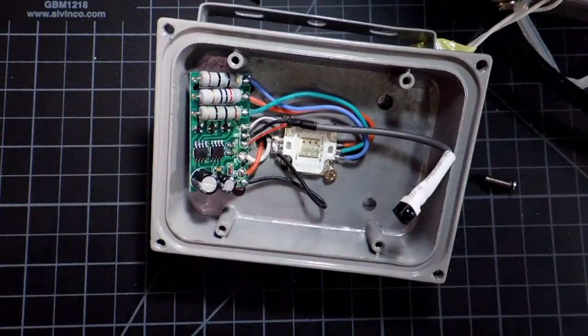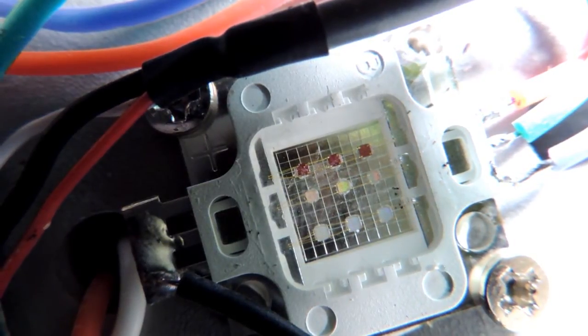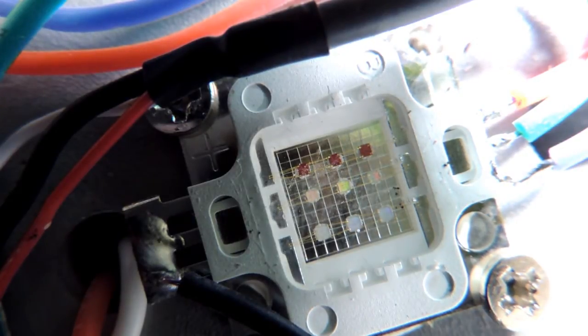Let's take a look at the actual LED. Zoomed in here, you can see the LEDs are put onto a little substrate and they've got bond wires — sort of chip scale packaging. You can even see the phosphors: the red, the green, the blue, which create the constituent light colors. Of course, when you turn them all on you get white light. A fun little module.